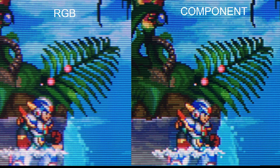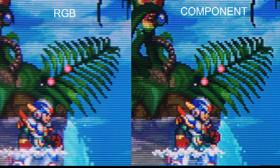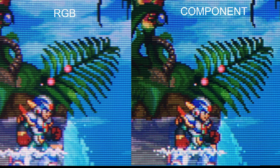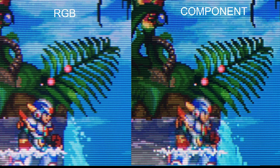As I mentioned, I had to adjust my knobs between recording RGB and component. Before that, I calibrated the white balance on my camera to match the pro monitor, and I set everything on the camera to manual so it wouldn't auto-adjust — focus, ISO, white balance, frame rate — all locked in so nothing would change. Then I got my RGB dialed in first, pulled up my blue screen with SMPTE color bars, calibrated the color, brightness, and contrast, and recorded.